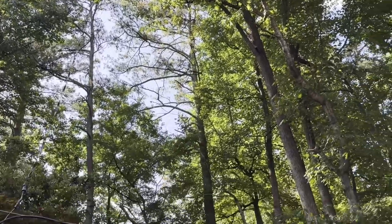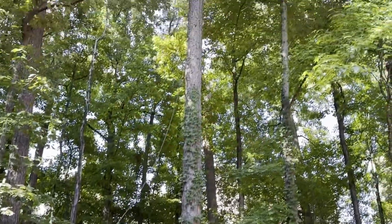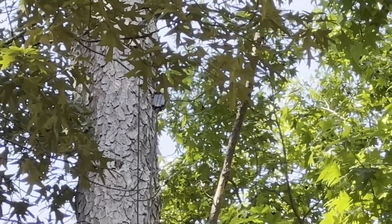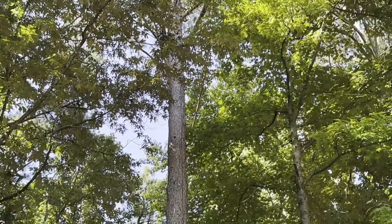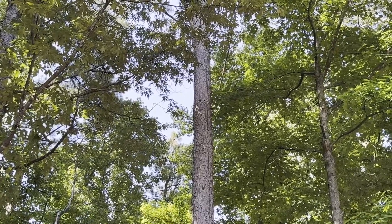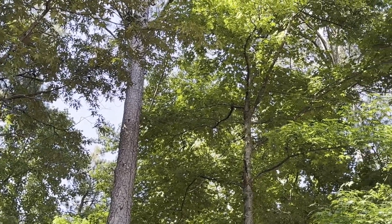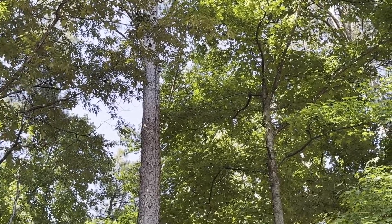I hope you enjoyed my antenna work today. I'm thrilled that I get to keep the off-center-fed dipole — this tree crew was magnificent working around my wires. There's the Fritzel FD-4 — kind of a backup. It doesn't outperform the doublet and the ZS6 most of the time, but it makes a really good receive antenna. And it's one I can get quickly on a bunch of bands without even turning on the amplifier, which has my antenna matching unit in it. So I kind of like to keep it.